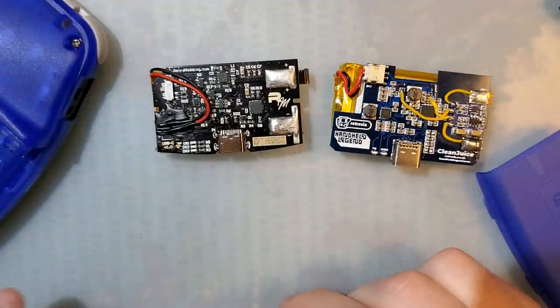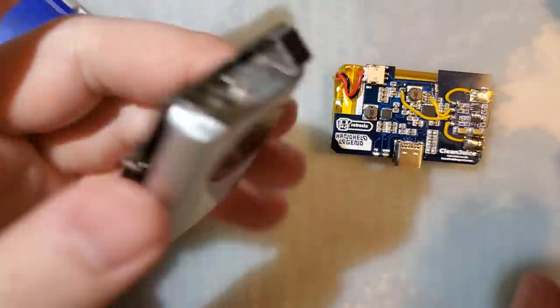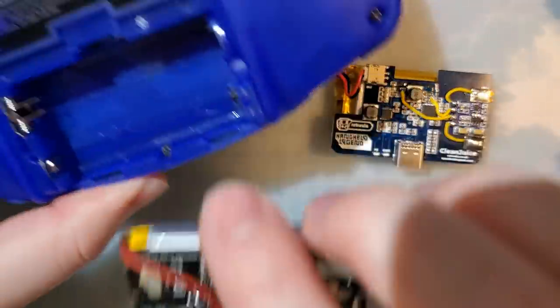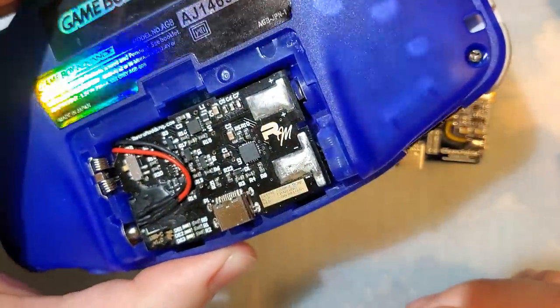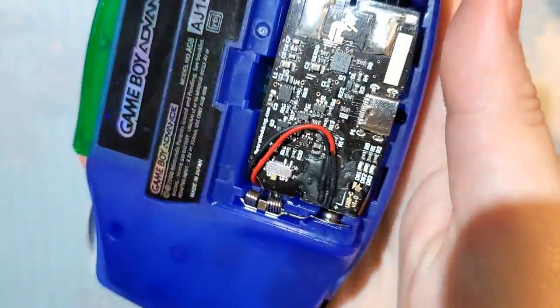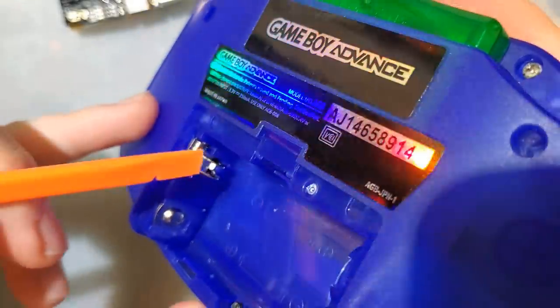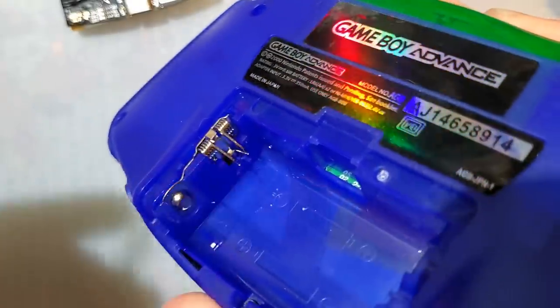But that's not to say that the RetroSix battery was the only one with quirks. You've seen me shoving this in and out of here, how it's more difficult. It goes in pretty easily, but as far as coming out goes, you hear something just snaps into place and it doesn't come out easily. You can pry it out pretty easily, but RetroModding's own instructions tell you you need to remove this battery tab.